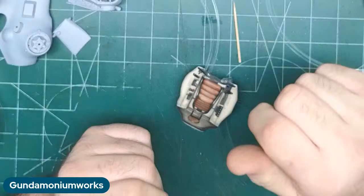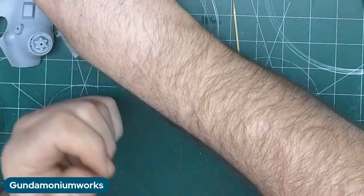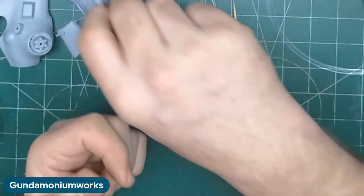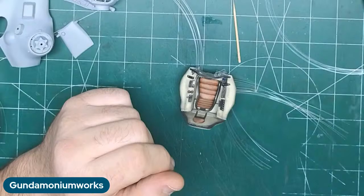And then I could also even light up, let's see, where is it? I thought it was on, oh, it's on the nose. This piece here, there's a glass lens that goes in this little oval. I thought about cutting that out and putting another LED there, but then I would have to rethink my power supply and stuff, because right now it stands at three LEDs, and that's perfect for a 3-volt battery. I don't have enough space for a 9-volt. So unless I run it externally, which is another trick to figure out. Green.